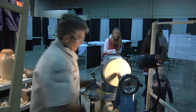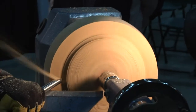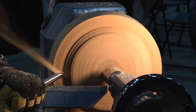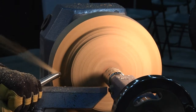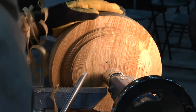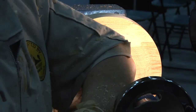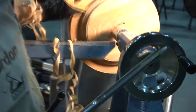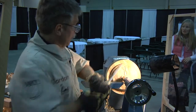And now we're going to clean up the face, and then we will start plowing out the middle of the log. This is also a bowl gouge. It's just cut to a different grind, so I can get a peeling cut. It's similar to a David Ellsworth grind, and it gives me the nice long shavings as I'm peeling that off. That might still give us some problems, but I'm going to stay with that, and I'm going to chew the rest of the face up.